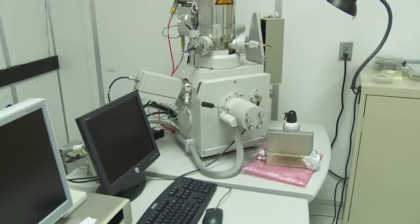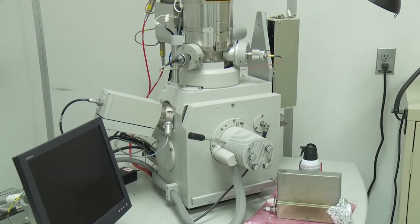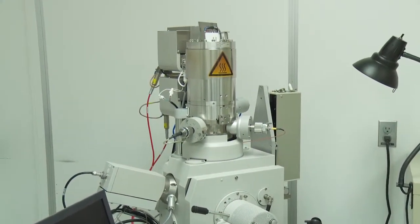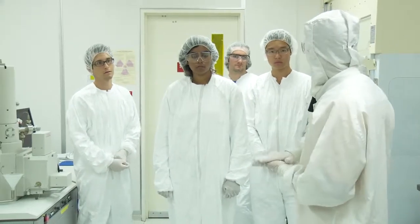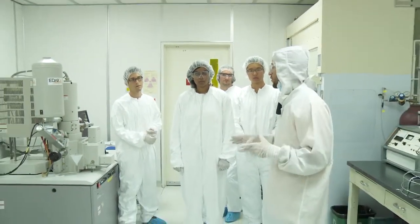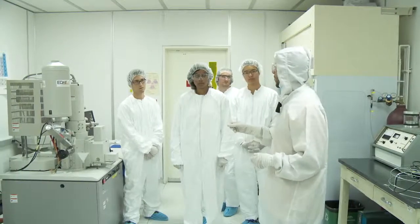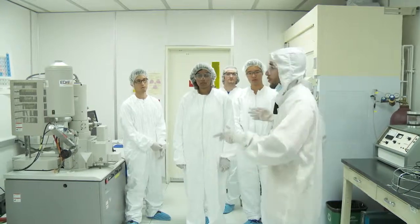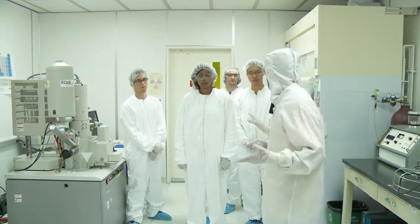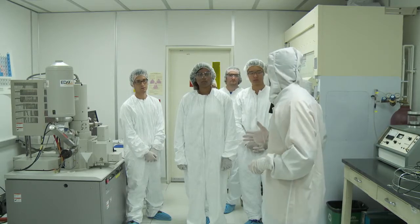We were discussing the masks and everything. So when you do photolithography, one option that you have is that when you have your photosensitive material, you put it under a UV lamp, and between them you put your mask, so you create patterns in your photosensitive material. The other thing that you can do is just write straight into the photosensitive material with a beam of light or electrons that ablates that photosensitive material, and that microscope can do that too.